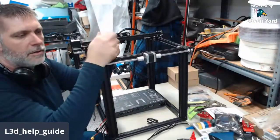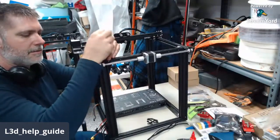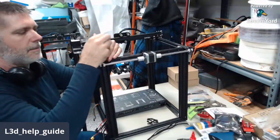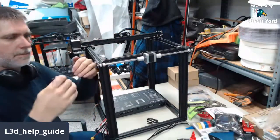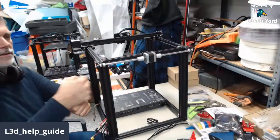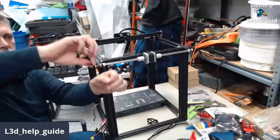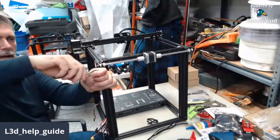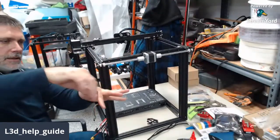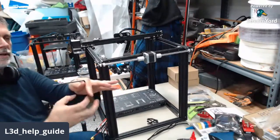Yes, even with the upgraded pneumatic couplers, the metal teeth dig into the stuff, and you can almost see it yourself when you go to take it apart, especially on the Ender 3 that you have, where the head's going back and forth. So that tubing, if you can imagine my wrench is the tubing, is getting oscillated back and forth as you move side to side, right? And those teeth are just sitting there cutting in, and then once it gets that little tiny void in there,